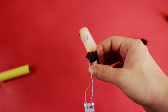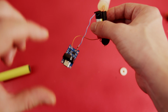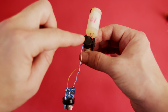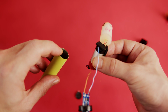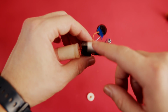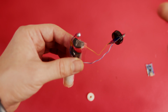One of the most important things here is connecting the correct poles, and of course, as I mentioned here, battery minus should be connected to the negative and black one in this case, and battery plus should be connected to the red side of the battery. And also there should be no open cable ends, because the case itself is aluminium and it can create short circuits, so just better be careful about this. I ended up using a plastic tape to hold up the insulation caps, but if your insulation caps are still holding some glue, maybe you don't need to do that, it is just a little bit of protection.